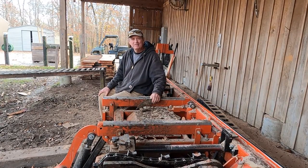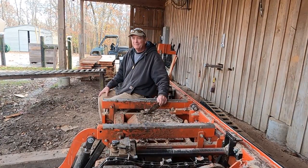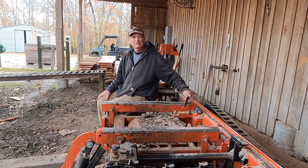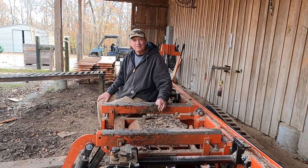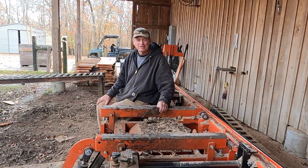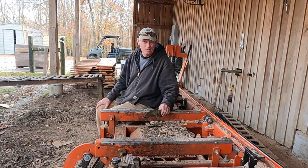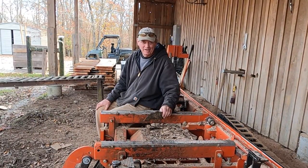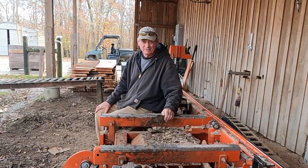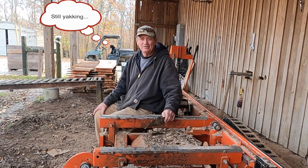So when you're trying to get that real thin board at the end, you don't have any way to clamp that. If you overclamp, it's just gonna pop out because there's no square edge for these things to hold on to. Well, that's fine. If you got a 1,000-pound log on the sawmill and you got a bandsaw going through it, don't clamp it. Just go slow. When you go slow, the weight of the log keeps it on the bed. You don't have to worry about hitting your clamps, or worse yet, you don't have to worry about the log popping out of the clamps and you're getting a tapered board. So that's an important tip. You don't always have to clamp. On the other hand, another important tip is you really need to know when you can clamp or not clamp, because if you don't clamp and you should have clamped, it's going to be a mess. So I don't know if that's a helpful tip or not. That's just something that I do.